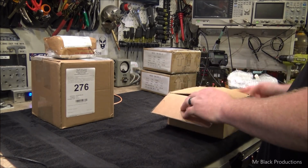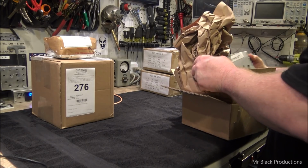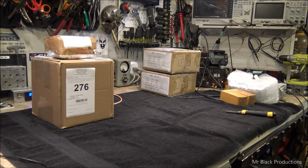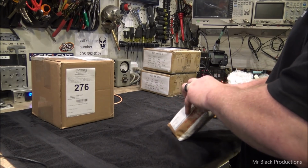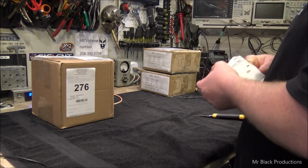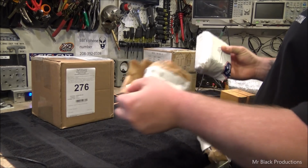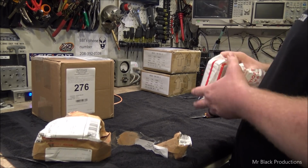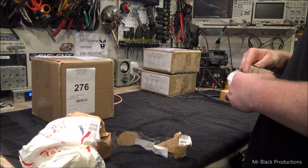I don't know if you guys have priced the cost of new oil-filled capacitors, something that is not taken from an old Henry generator cabinet or nothing. But I know what I paid Henry Radio for 2 brand new oil fills day before yesterday. Small fortune. 7,500 volts continuous applied voltage at 16 mics. Unbelievably expensive, by the way. Like, breathtakingly expensive. I couldn't believe it.